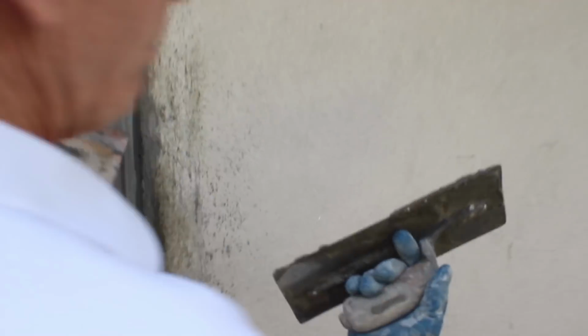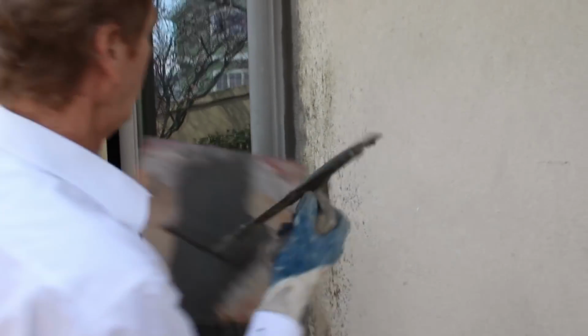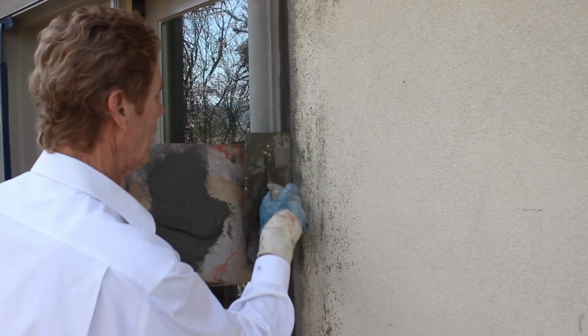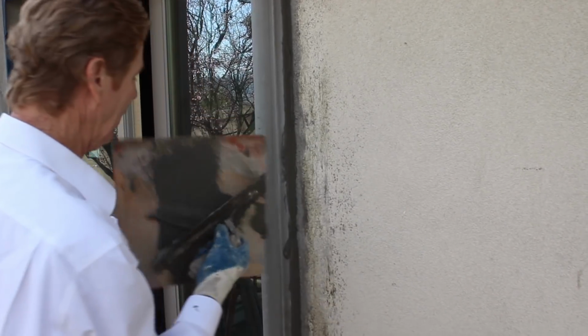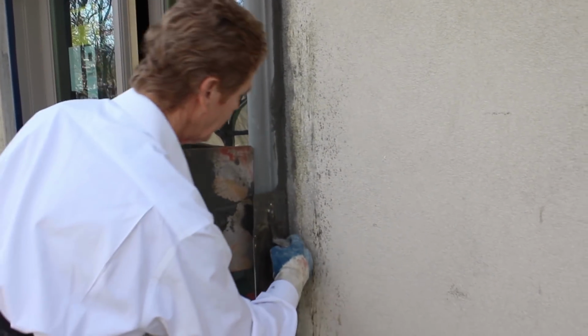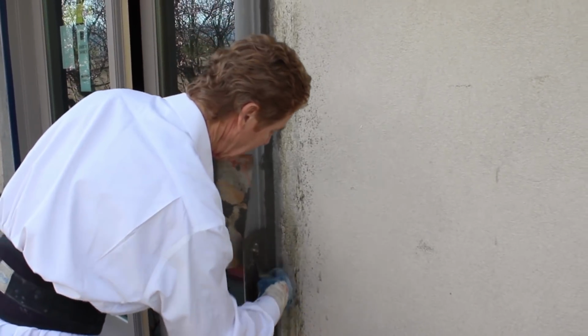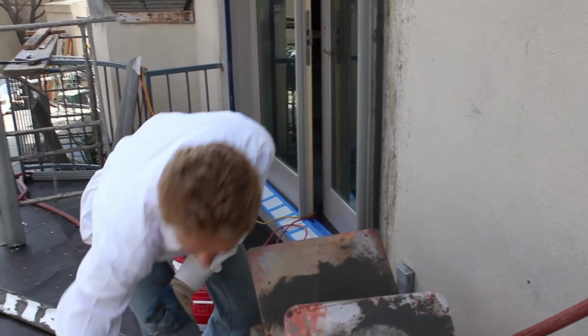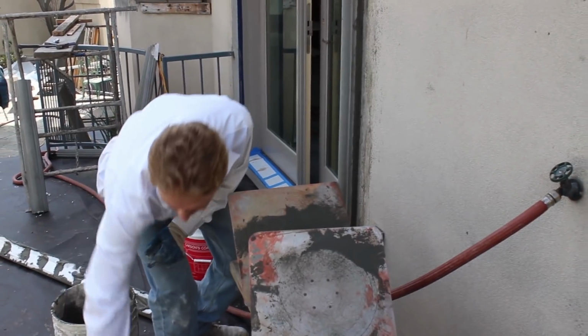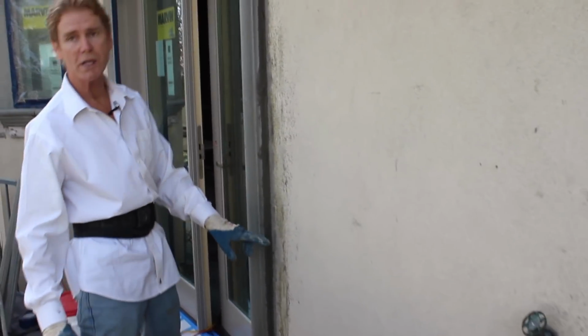And what I'll do is I'll butter my joints up this way. I mean, I'll take it here because there's going to always be a gap. I don't care how good a plasterer is. If you think that wall is perfectly straight, you're out of your mind. These walls sometimes have anywhere between an 1/8 and a 1/4 inch gap. Yeah, 1/4 inch gap, that's right. I've done it where even us will do a wall, and if it got a gap, that gap's got to be filled, and this was what gives it strength too.